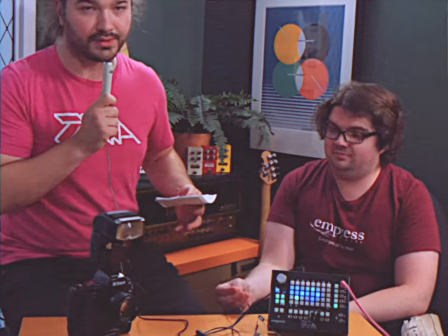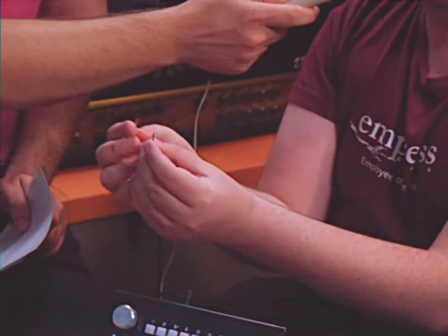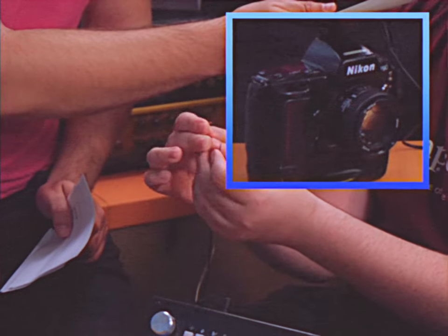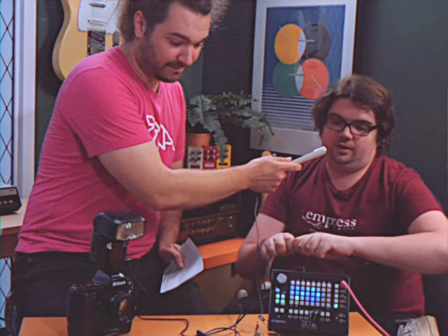This creation of yours, how does it work? Explain it to me exactly. So this is just the thing attached — that's the cable out that goes to a TRS. This is your ground, and then one of these cables triggers the focus, and then the other one triggers the shutter. All I've done is hook that up here.